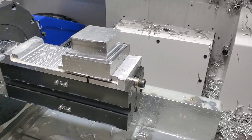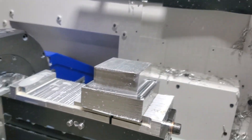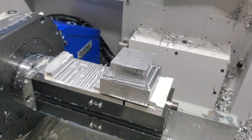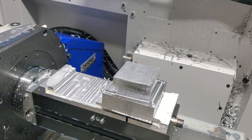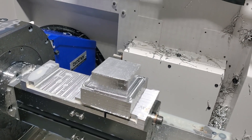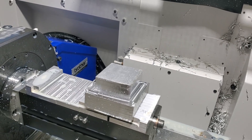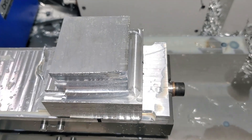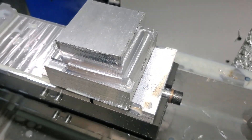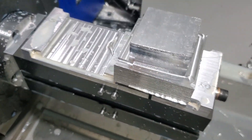The part lifted quite a lot on the last cut, but I think much of the problem is from the mistakes I mentioned earlier. Still, this is a bigger part with decent cuts using a 45 degree helix end mill, which does apply a lot of forces on the part. This was to test how well these vises work mounted this way, and it passed in all respects. Everything sounded stable, and if you look at the floor of the cut, it is nice and smooth. There are no signs of chatter or anything else to tell me the vise wasn't mounted well enough, so I am very happy with the results.